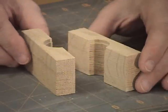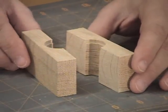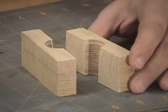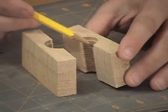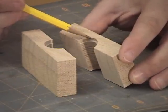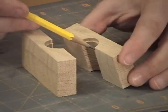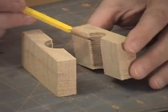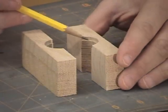I've got the two halves of my clamp back at the workbench and I want to point out a couple of important things depending on how you plan on cutting out your coins. This lip right here determines how close to the edge of the coin you're going to be able to get your scroll saw blade. So if you really want to cut close to the rim, you may have to sand this inner lip down just a little bit so your blade can get closer to the edge.